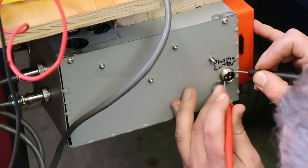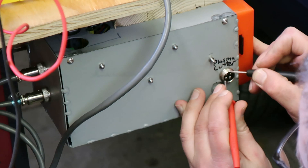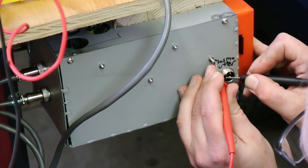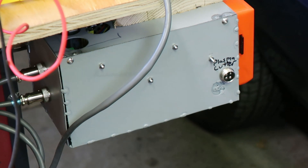Got the multimeter — we'll check the contacts in that relay. We don't have anything, nothing to ground. So contacts are okay. It's possible the interference from the plasma cutter is holding the contacts in a high state — it's only a five-volt signal, and some of that stuff gets affected a lot.